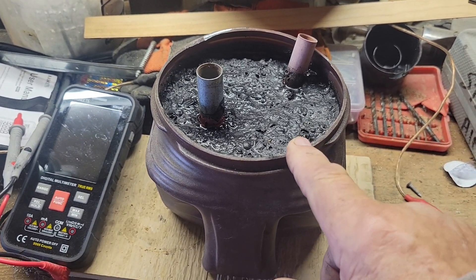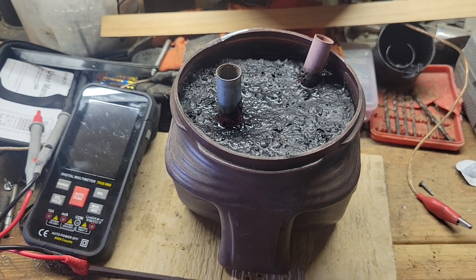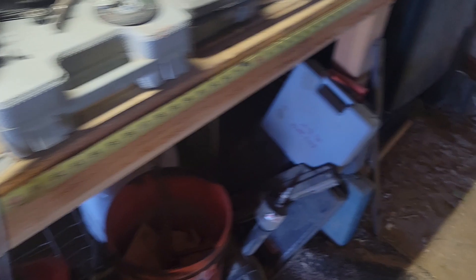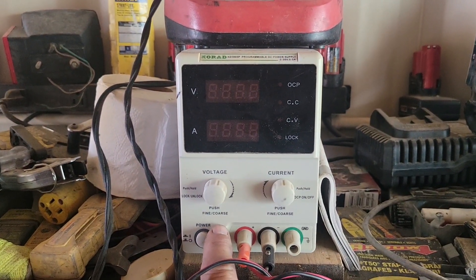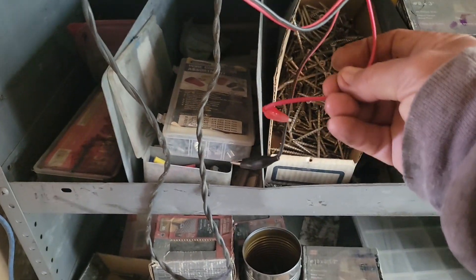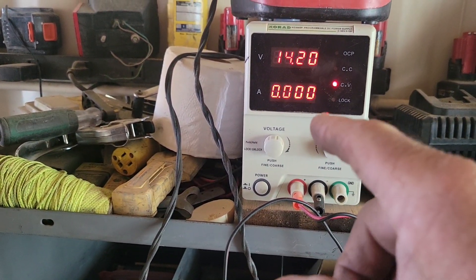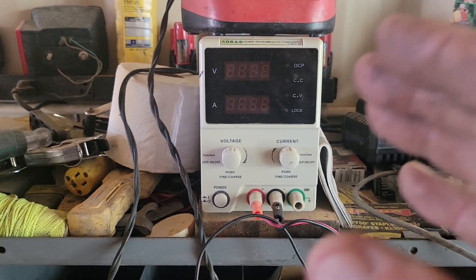Now, that's got everything in it, as you can see — it's got the charcoal floating on top, it's got the acid in there, and it's got the dirt below it. But it never got over, let's say, a third of a volt. That's all I saw. So I wondered, what happens if I charge this? That's why my voltmeter was over here. I took my AC to DC system, set it at 14.2 volts, which should give a good battery charge, and connected my wires up to the battery. It started off at the 14.2 volts and had high amperage — it was showing 8-point-something amps. And then the amps started dropping and dropping and dropping.